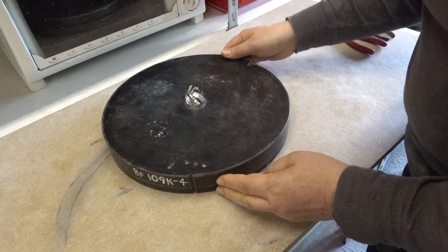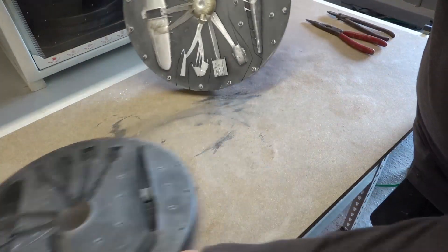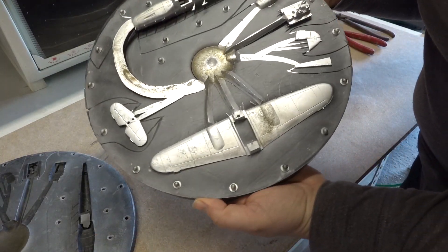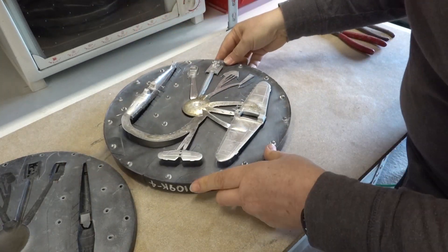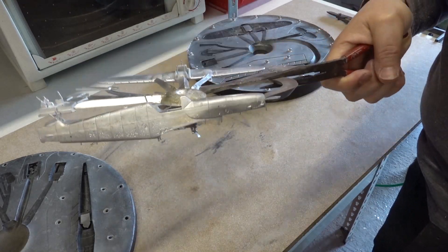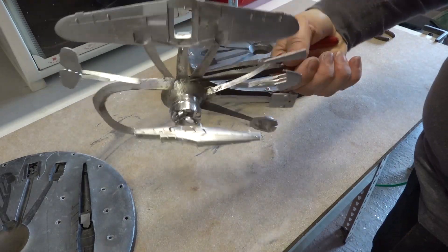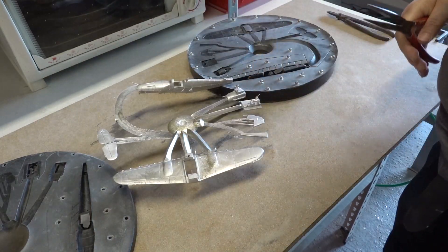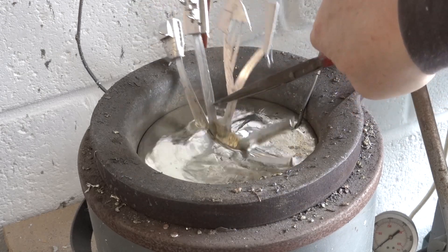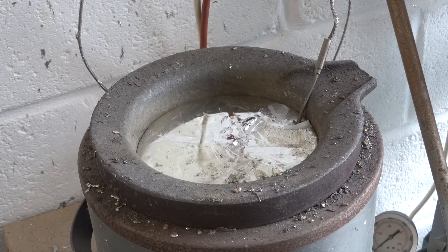With the metal solid the mold can be opened and the castings removed. The mold is then quickly re-talced and prepared to go back into the casting machine before it drops below its optimum temperature. The fuselage and some of the parts weren't up to quality and so they go back into the pot and are melted back down together with some spare castings from the previous production batch.